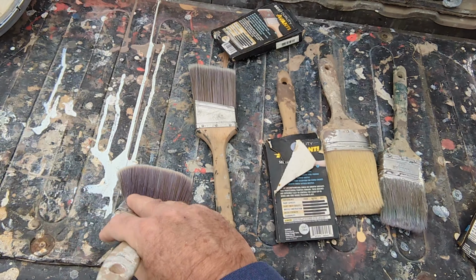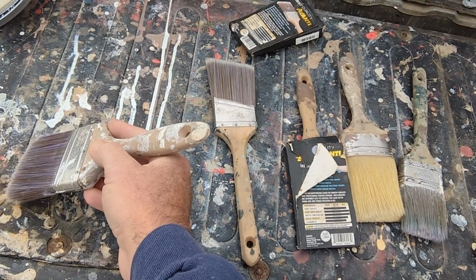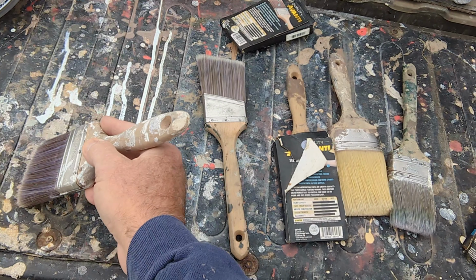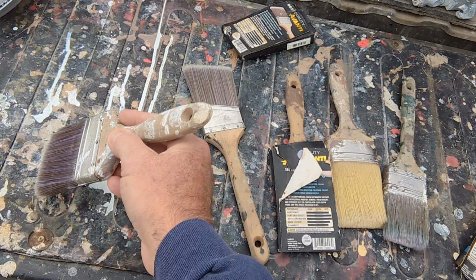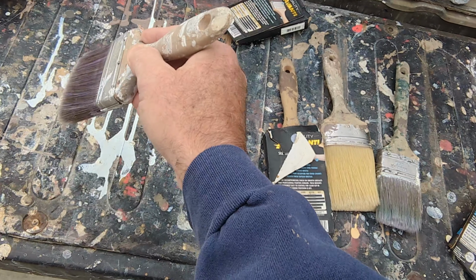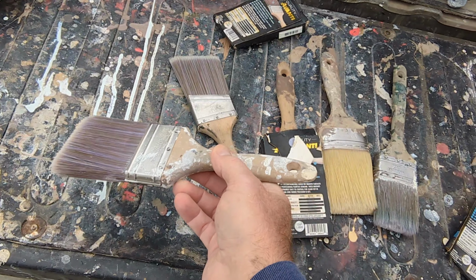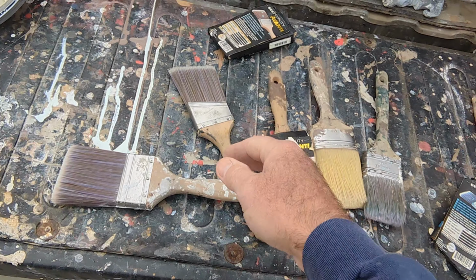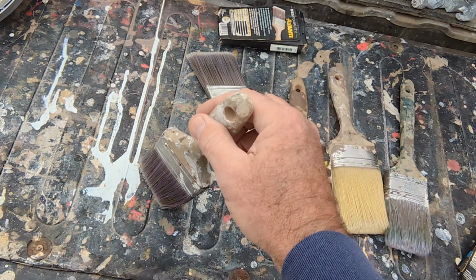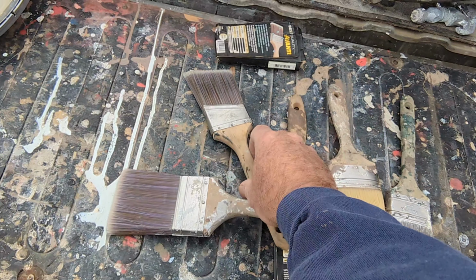But on the wall portion, when you're trying to get good coverage, you'll be getting better coverage with this because you'll be lighter on your tips. So I talk about this a lot on brushing. Pushing down gives you better control. Lighter gives you better coverage. So now, a lot of times when you had to double coat a room, you're going to get it in one on the cut.